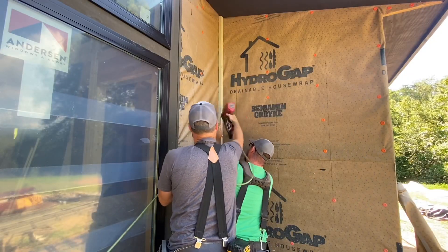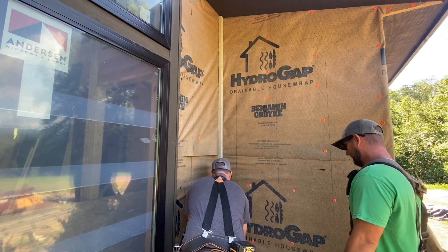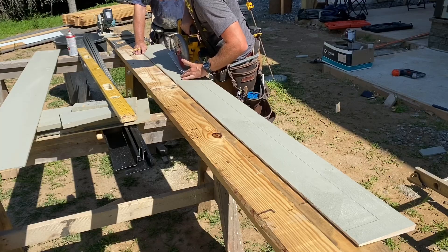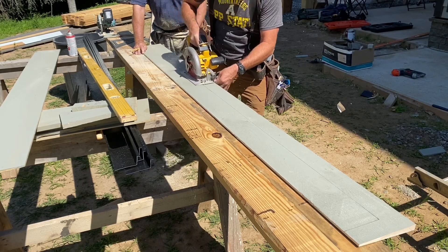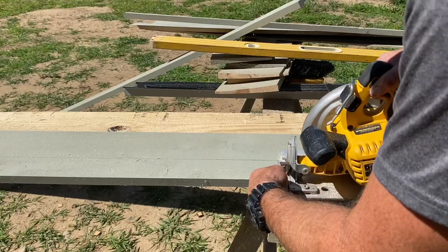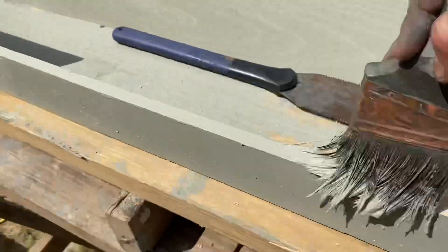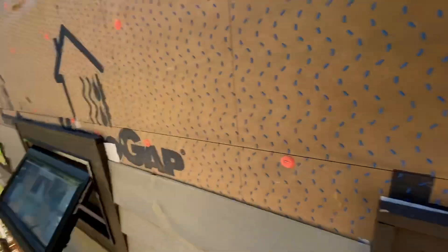This is one of the inside corners, which I missed in the last video. It's painted the same color as the siding — it's simply a two-by-two, it kind of just fades into the background. Some of the trickiest saw cuts on siding are notching for the top and bottom of the windows. I like to use my finger as a clamp on the saw base as a guide to keep the saw running straight on the rip cuts — this helps to get a fast, clean cut. After making any cuts on this pre-finished wood, we refinish the wood on the cuts.